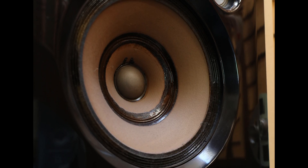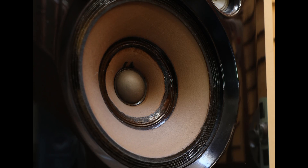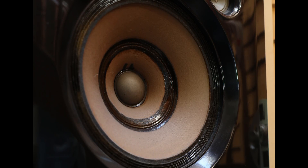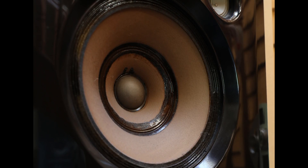I was thinking, what's going on? One gets used to the sound and forgets about it. Until one day — I still have these speakers and we can show them — these are speakers that had a combination of a very unique driver: the Altec Biflex, taken from a Santana guitar amplifier. It's basically a full-range driver: a 15-inch with an 8-inch glued inside the 15-inch cone with a soft surround, and they all share the same voice coil.